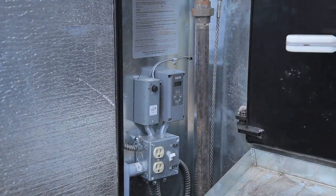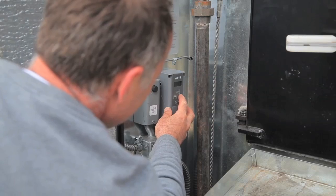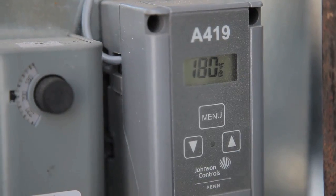Now, all outdoor boilers use an aquastat of some kind to control the water temperature in the water tank. The aquastat turns the fan on or off depending on whether additional heat is needed in the water. They let you set the maximum temperature that the water will be. Now, the Portage and Main unit that I have comes with Johnson brand aquastat controls. These have proven reliable for many years in the industry. They're widely available and economical if you ever have to replace them.